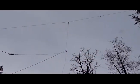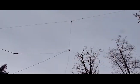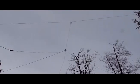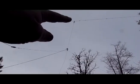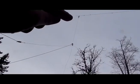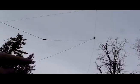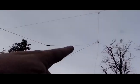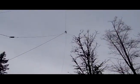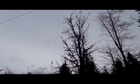Well, here's my antenna. There's a rope going across between two trees, and in the middle is a vertical about 102 inches long. It's been tuned with an SWR meter, and along the sides is the coax that goes into my house. This is a radial insulator, and there are three of them: one over here, another one here, and another one behind the tree. You can't see it too well.